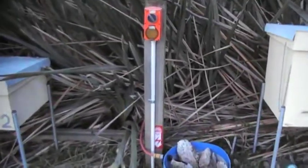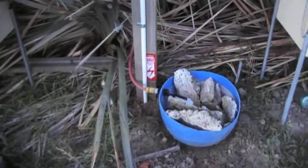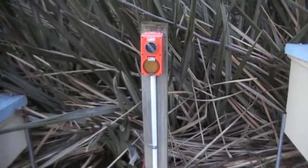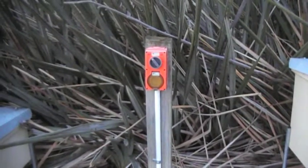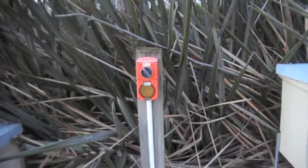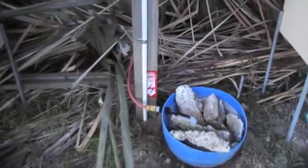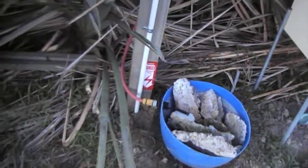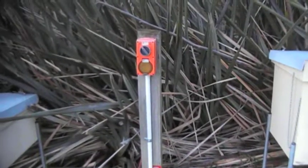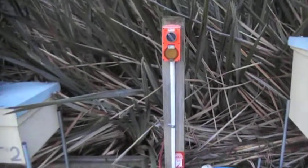and then same as the other end, just up through the conduit from 600 or 700 mil deep up here, and then I've got a 10 amp switch out here at the apiary, which is, I've got another one I picked up second hand, the same, that I'll put on the glass house in time as well. There's also an earth strap down there that you can't see, it's behind that water trough. So that was it, my little job. That has been a bit of a, well, it's taken me quite a few weeks so far.